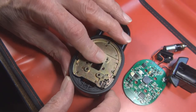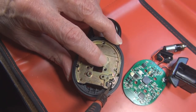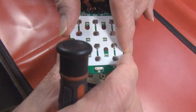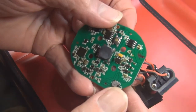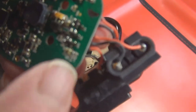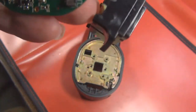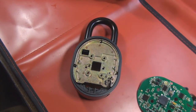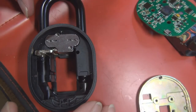I made a mistake earlier - I wanted to show you: I push this down and this little flapper comes up. See this little item here - it goes up and down. Well when the circuit board is on there, what hits that flapper is this little switch here - this little S1. This is a tiny little switch. So when the shackle is all the way down, it tells the circuit board to turn on the motor in the opposite direction and lock the lock.